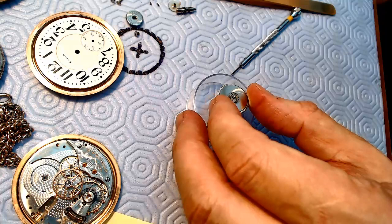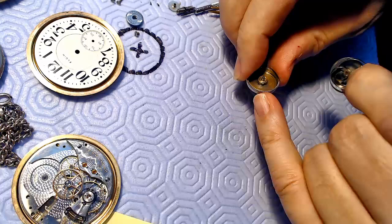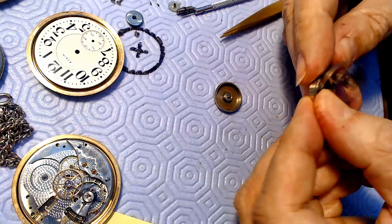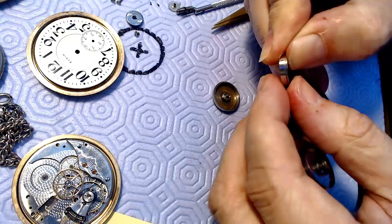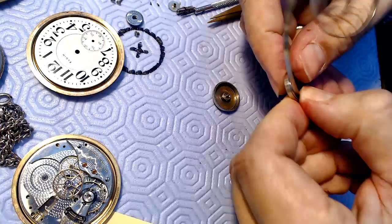All right, so this mainspring, I'm not sure why I have this plastic container here, but this mainspring wraps around this arbor here. And if this arbor comes out, it should come out. But there's the barrel for the mainspring. I just took it out a bit and then reversed it. Now I've got to walk the mainspring out, because this thing is going to fly in my face any second. But I've got to figure out why this thing is slipping. If I look closely before I wind it out, and look at the way it sits in here, it's kind of a weird configuration. So I have to wind it out and then figure out whether somebody just jury-rigged this thing. So I'll be back.